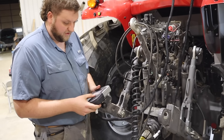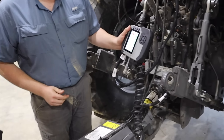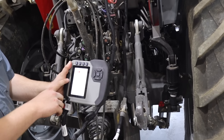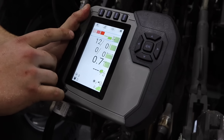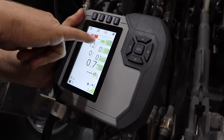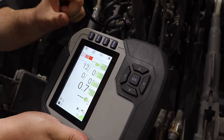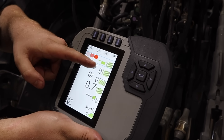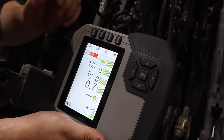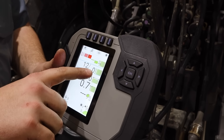Here's your basic home screen. All these are configurable to different categories you want. The top section is what we call the driving lights — each one updates with your flake. Every time you make a new flake, this will update. Red means you're going too fast, bale's too big; green below the center line means you're going too slow — speed up to get your flake count. Flakes per bale shows your current and your last bale.